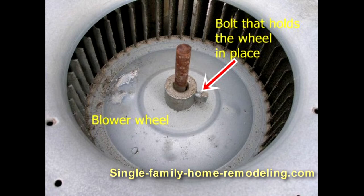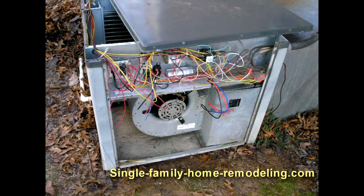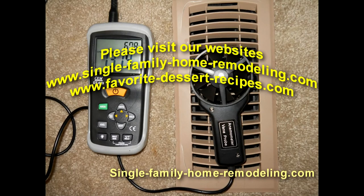There's one bolt — you take that bolt off, spray some WD-40 on that shaft to get it out, slide the shaft out, which lets you pull the motor apart. We put the new motor in — about $150 direct replacement from the manufacturer — put the pieces all back together, wired everything back up, and here's a picture of the blower reinstalled. We turned it on, made sure everything works, and checked inside the house — about 131 cubic feet of air coming out of the unit.